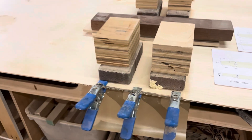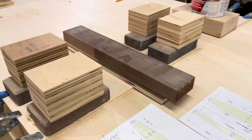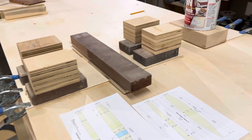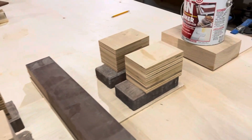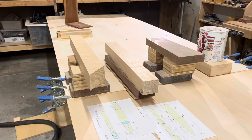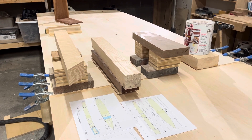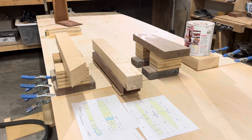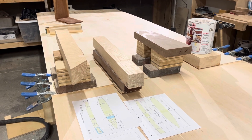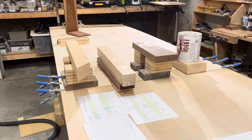The critical thing is you've got to put wax paper underneath it so it doesn't glue to your workbench. I'm using a 10-inch wide butt joint plate. The bottom of the boat will be here and one of the sides will be over there. Quick note: I did use Titebond 3 for this butt joint and it works very well.